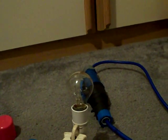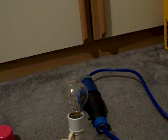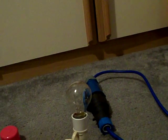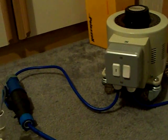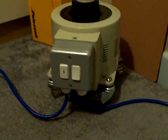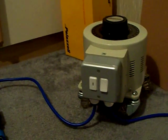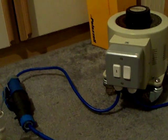That 60-watt filament bulb will allow the variac to start up but will dramatically reduce the inrush. In fact, in my bedroom when I try to power up the variac, it makes my 16-amp circuit breaker pop — specifically a British Standard 3871 type-one circuit breaker. So I have to use this soft starting technique every time I want to start my variac in my bedroom, because the circuit breaker just will not have it otherwise.